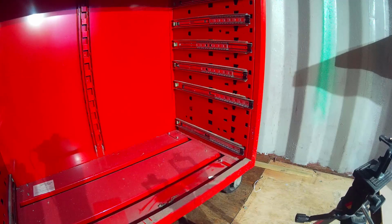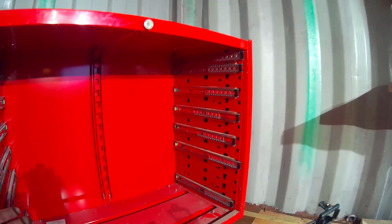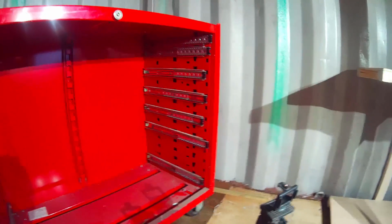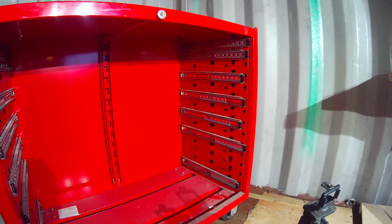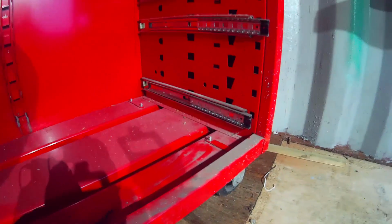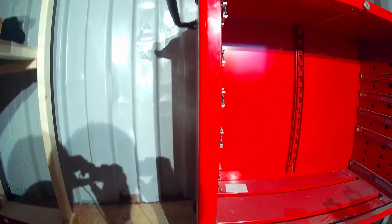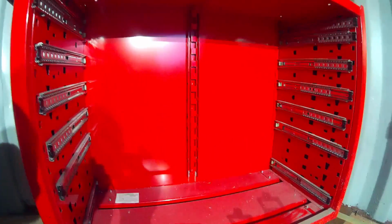This one is a design that they've been with since the 50s, I suppose. I'm personally familiar with this design of toolbox that goes right back to really old ones anyway, like roll cabs that are at least 50 years old, and maybe not the 1950s. I don't know what Snap-on were up to around there, but they weren't in the UK anyway. Either way, everything's just been well developed and added to. They've got doublers on the casters there, the wheels that come through, and they've got nice heavy plates on the back of them. The thickness of these sides just adds so much strength to it all. The locking channel on the back is really substantial. That stops the back of the box wobbling about too much as well, because only the middle of that moves.